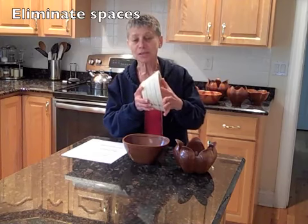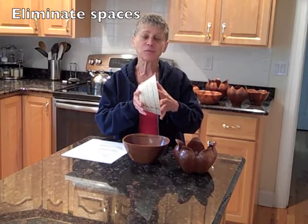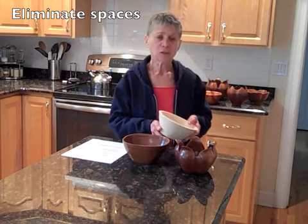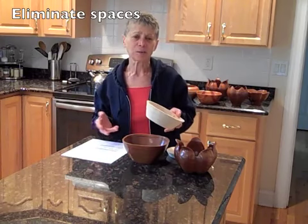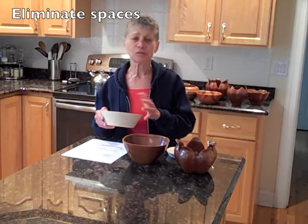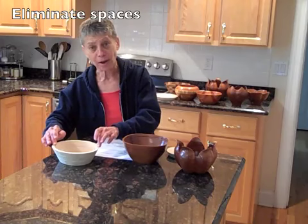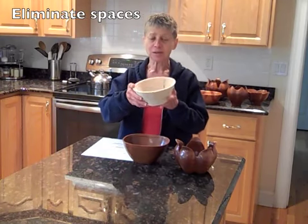And they are typically so far apart just enough so no matter how hard you squeeze it, they simply will not give. And you're going to end up with a little bit of a glue line, and that will spoil the illusion of a single piece of wood. So what I typically do for this, I work ring by ring on a 12 by 12 granite tile, big box store stuff, with a piece of sandpaper, 120 to 150 grit, something like that, attached on top with a temporary bond adhesive, and I'll put it down on the surface. I'll tap it to see where it's rocking, which tells me where the high spots are, and I'll push down selectively until I put these together and they're absolutely flush.